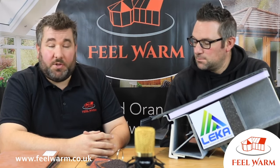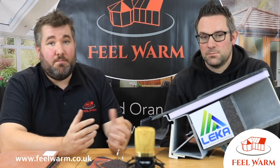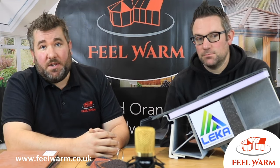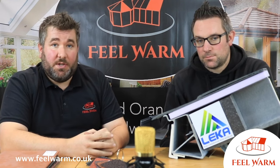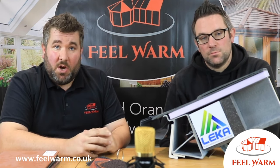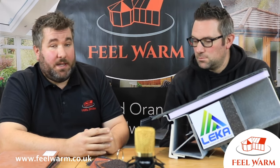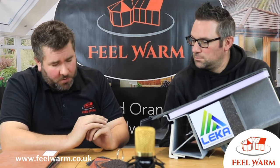I've had another one where the customers had to get building control in to check for subsidence, to rule that out, because their conservatory frames were leaning and moving and starting to break, you could see the conservatory coming forward. They hadn't been inside their conservatory for 6 months because they were that scared it was going to collapse, and that was ultimately down to a timber roof that had been installed on top of the conservatory frames. It hadn't been correctly designed, it hadn't been correctly constructed, and it was too heavy, and of course it was collapsing the conservatory. And again, that's resulted in a full conservatory roof change for a professional system. So yeah, don't get an overclad.